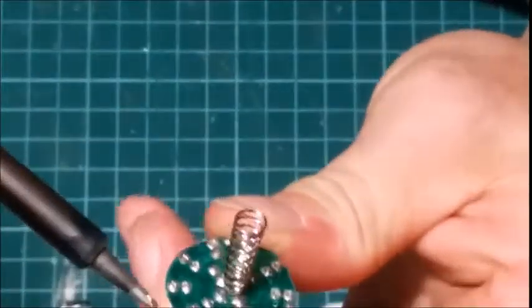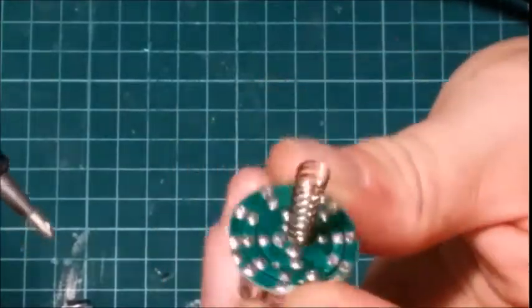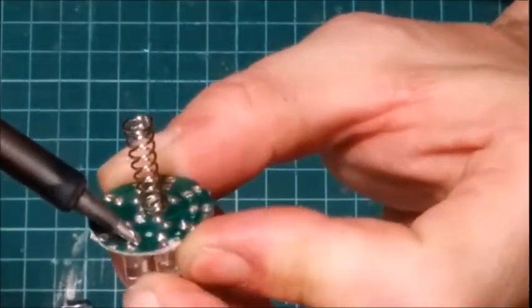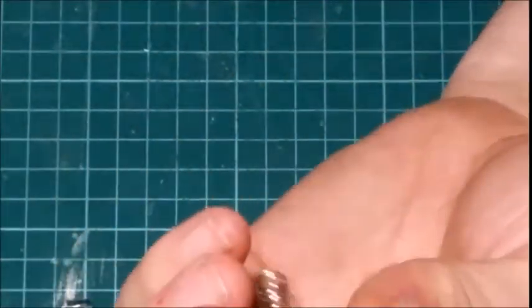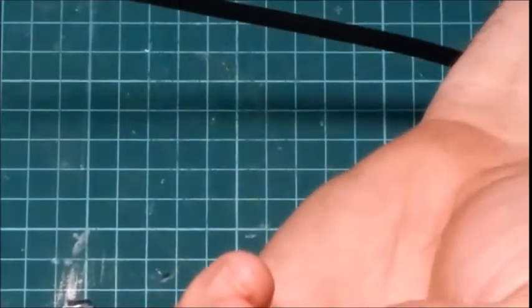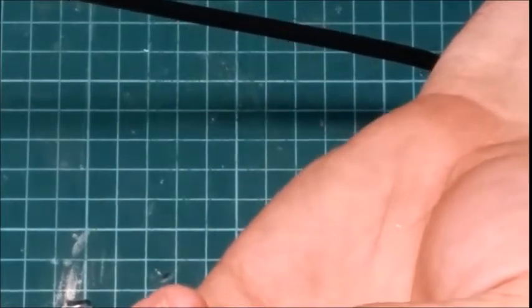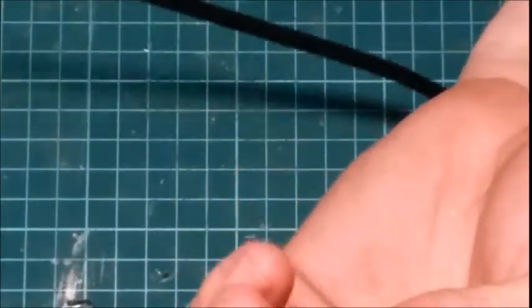And of course, try not to burn yourself. I've done it many times, and if you do enough of this stuff, you will. It's starting to get a little warm. So what you can do, you don't have to, but it'll probably make it easier, is as you heat them up, after you've got them out, you heat up a certain spot, and blow on it, it should blow the solder through the hole. And that'll clear the way for your new LEDs.